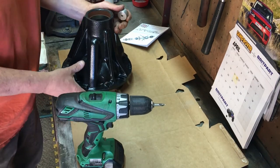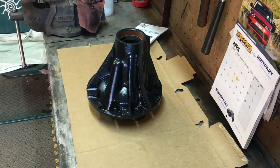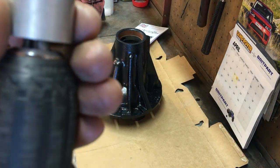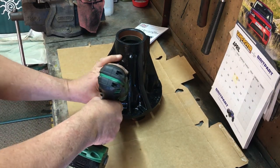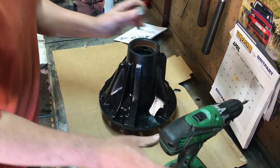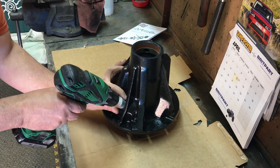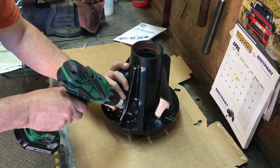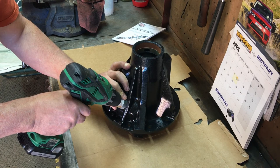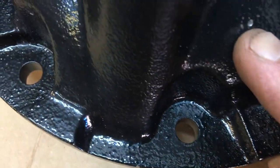Because this surface isn't flat, I want to make sure it's perpendicular to the surface when I tap it. I'm going to use this bush - hold it flat against the surface and then drill through with the bush in place. I come in here, position the bush, and hold it flat on the surface. That's made a spot now - you can see there's a spot where the center drill has been and it's made a mark, so I can now come in with the drill.